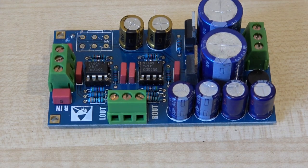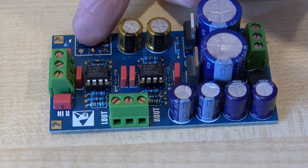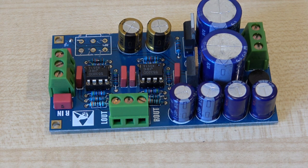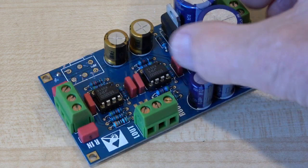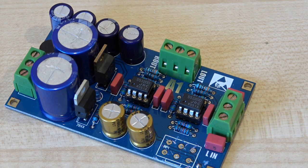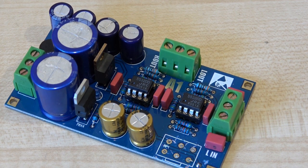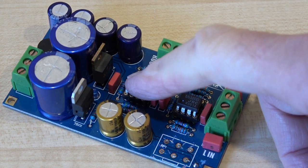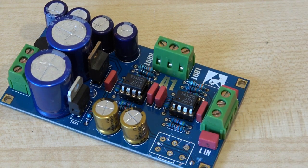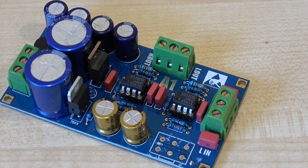This is the original preamp board I installed originally. It had a potentiometer on it which I removed because the matching was absolutely atrocious — nearly five dB out on one of the steps, so that's gone in the bin. I can't really explain why I don't like this board's sound, but it doesn't have a very neutral sound. I think it's possibly because one chip is used as a unity-gain buffer, and I don't really know why you'd need that because all it can do is add noise.